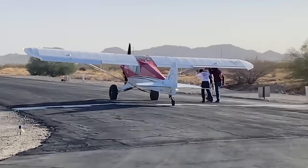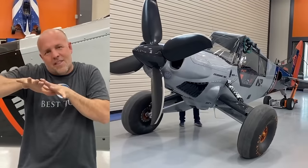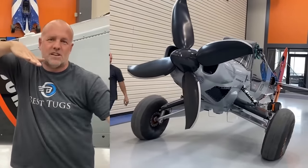If for some reason the wind really got picked up and I didn't dare turn off the runway because of the crosswind, I could add another level of safety and just hit 5 degree right lean or left lean so that the wing itself tips into the wind and the plane is still flat, squatted, and zero angle of attack.